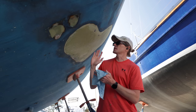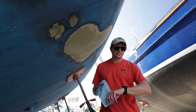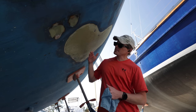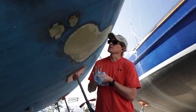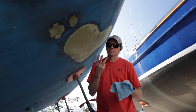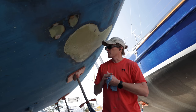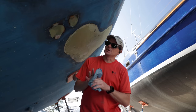We got all of the soft spots where it didn't cure because it didn't mix well. Now we're ready to prep the surface, mix some more up, and start laying it down. We'll let this thin coat set up and dry — at least three hours, maybe four — then we'll sand it all down and come back with one coat here and one coat there. Hopefully we'll have everything out to level in three coats. If we need to, we'll do a fourth — no big deal. We've got the time and the materials. It's looking really good.